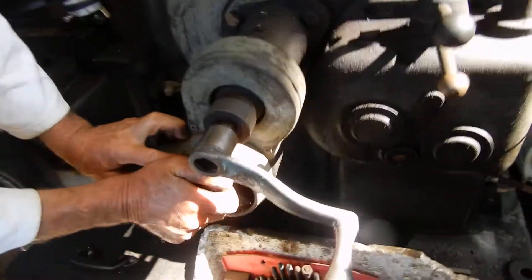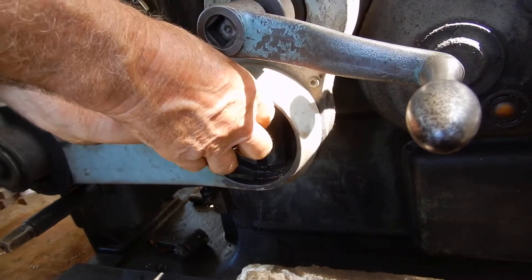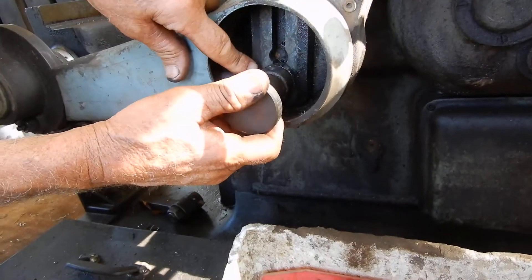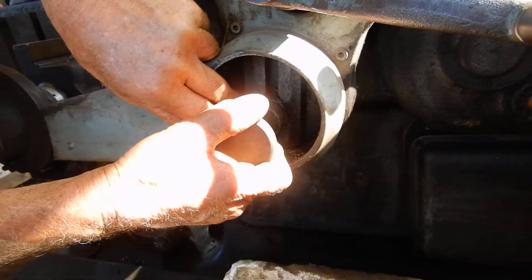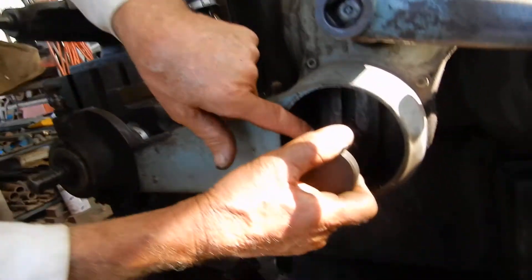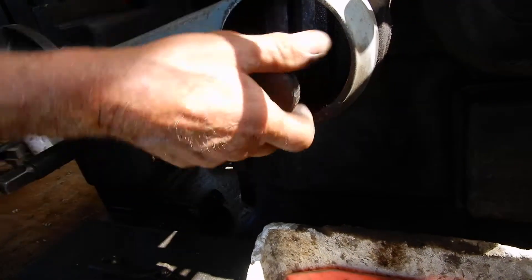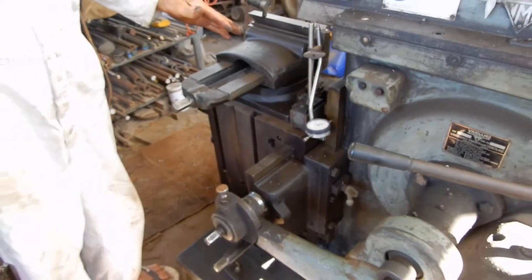So I'll go back here and put this in the original position. The position that you put this in determines how many clicks of the ratchet. If you have this towards the center you only get a couple of clicks; if you have it right out towards the outside you get a lot. In this case I'll put it fairly close to the center so we get a not-too-aggressive feed.